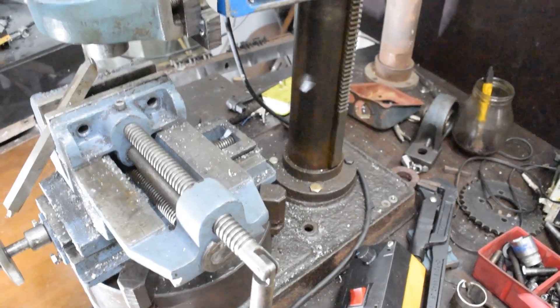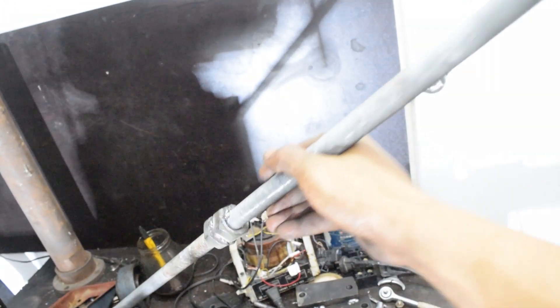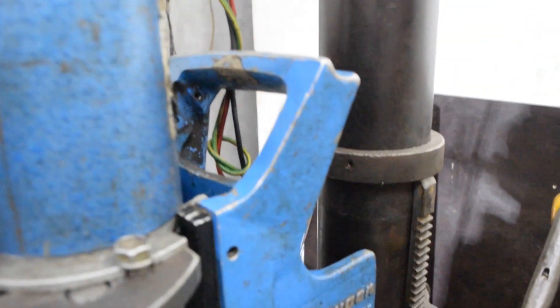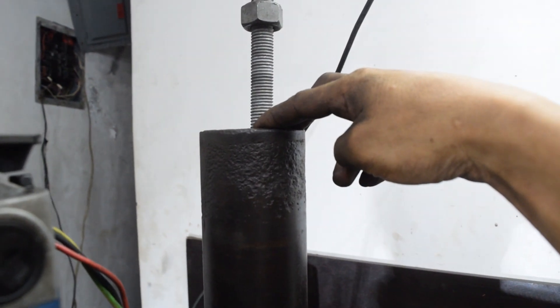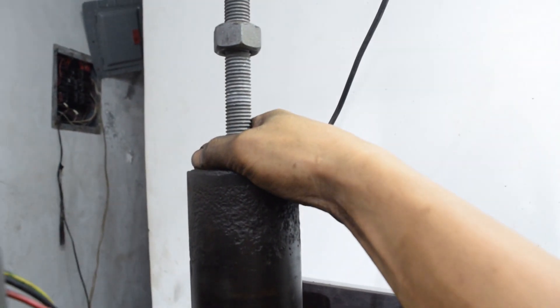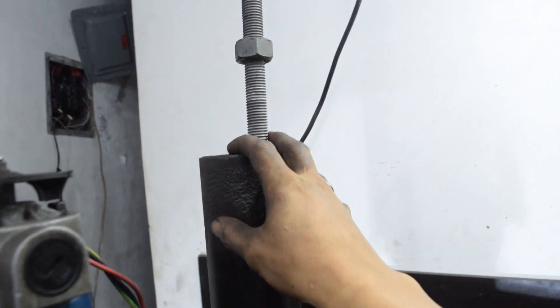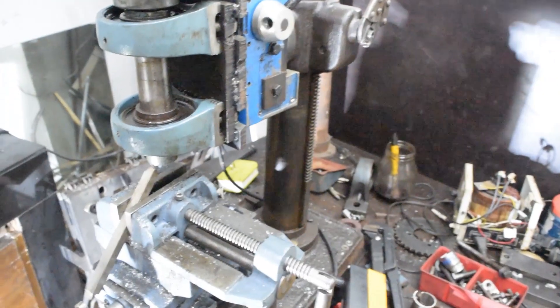An old friend who was able to see how the huge columns on bridges, skyways, and flyovers are made told me they are built differently than most concrete structures, so these bridges can handle traffic vibrations and tensile strains. So I'm thinking of doing that here — I'm going to make a concrete base and also pour concrete in the post, but I will put a tension rod in there. It's going to be tightened before the concrete is poured. In theory, when the concrete sets and hardens, you loosen the tension rod. The spring action of the rod will compress the concrete even tighter, making it basically stronger against vibrations and strains.